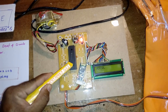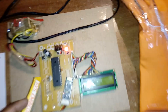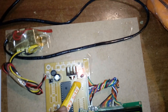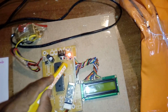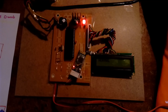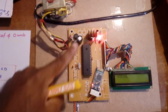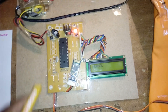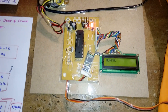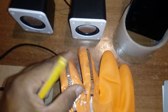Here I am using the PIC16F877A microcontroller. Ports RB, RC, and RD — that is Port B, Port C, and Port D — where Port B is connected to the 16x2 LCD character display. There is a reset button and a 16 MHz crystal. I am also using one HC-05 Bluetooth module, connected to the LM358 operational amplifier, and here I have connected the two flex sensors.